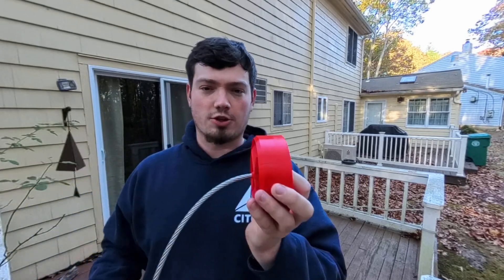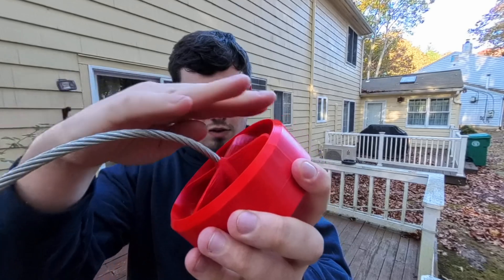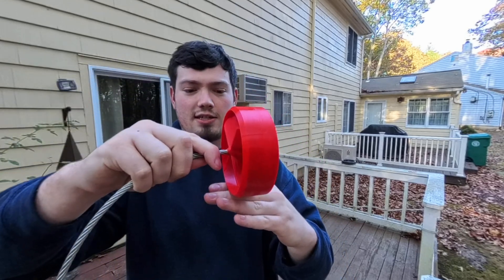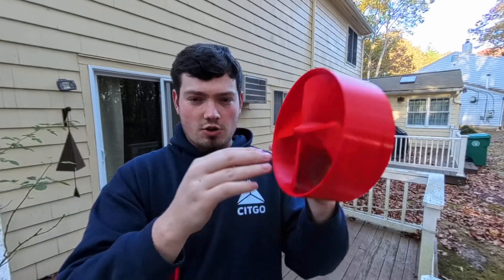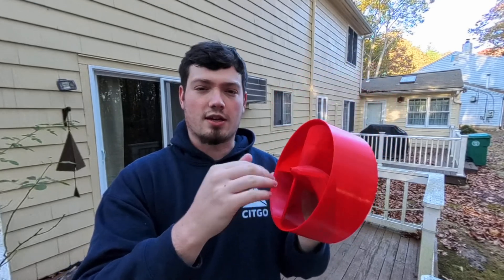This one still wants to push it out of the water. The chamfer — if you're not familiar — is this little angle on this piece right here. So this one's angling out, which means when it's hitting the water it almost wants to just push the turbine out, whereas this one is angled in, so now anytime it touches any bit of water it wants to suck it in.